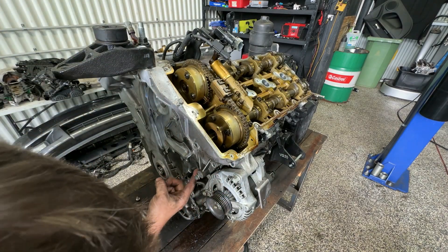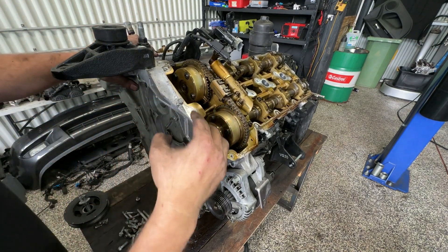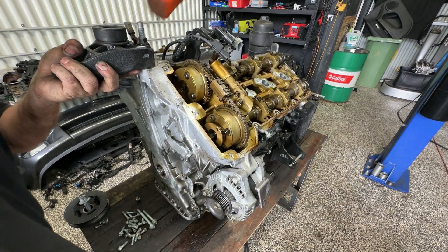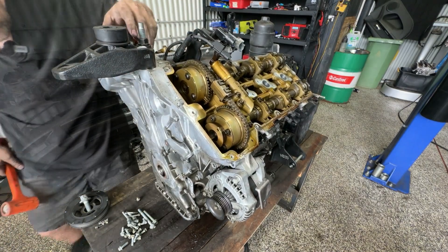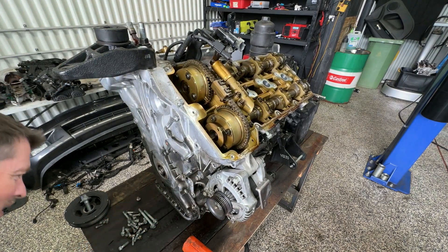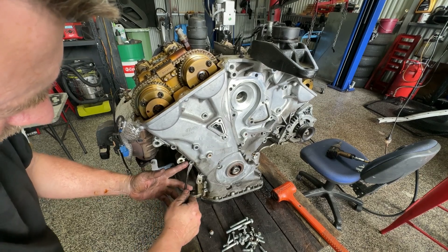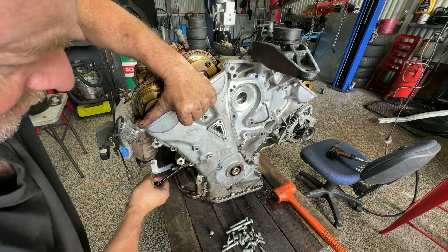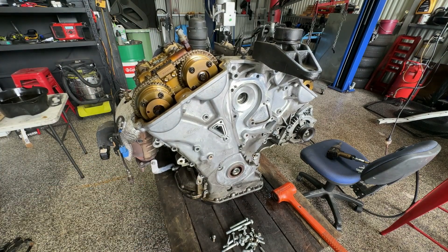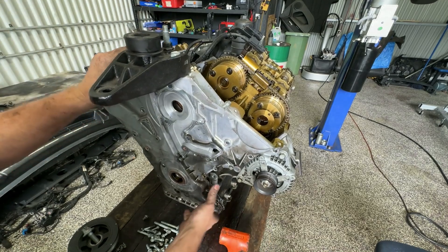Now I'm just looking around for any obvious easy points to lever this off — nothing is presenting. Sometimes in the castings there's a really obvious spot. Let's just give it a gentle tap right from the top here. Once the top has freed up a little bit, I'm just triple-checking there are no other bolts, because I'd look like an idiot otherwise. I feel fairly okay to lever from here because it's on the outside of that bolt hole. All I want to do is just go slow and start to break the silicone seal. It's come off nicely around there — let's see the other side, and away she comes.